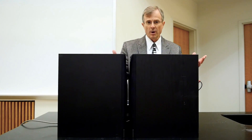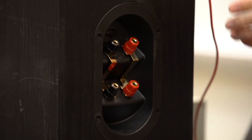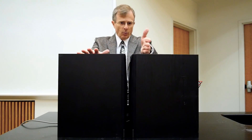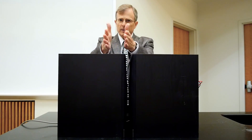If you instead connect them up wrong — connecting the red to the black and the black to the red with no change to the signal — then you get a much softer sound. Why is that? It's because this speaker is now out of phase with this speaker. This one moves out away from itself at the same time this one moves in, so they're moving back and forth this way and they don't push as much air around.